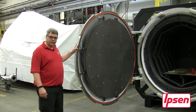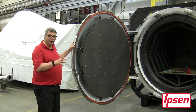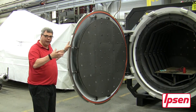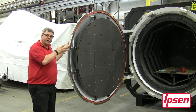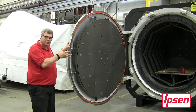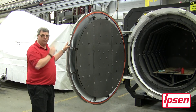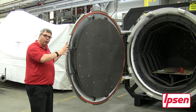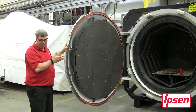We also fabricate furnaces where the door rotation is fixed — a non-rotating door with a locking ring mechanism, a true autoclave style that does the sealing and tightening. On other designs, the door closes and a ring locks to make the seal. In that application we would only use vacuum grease, whereas for the rotating door application we use strictly graphite powder.